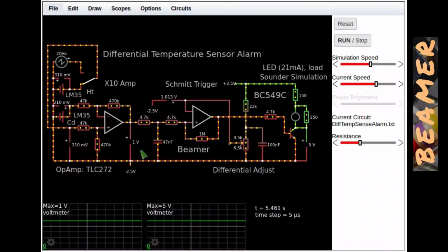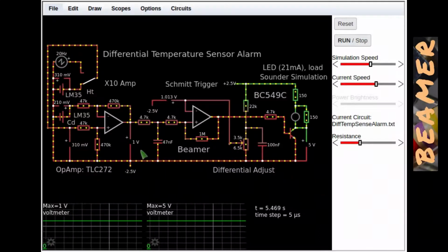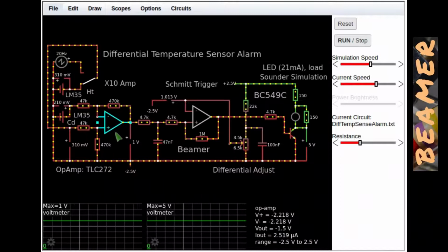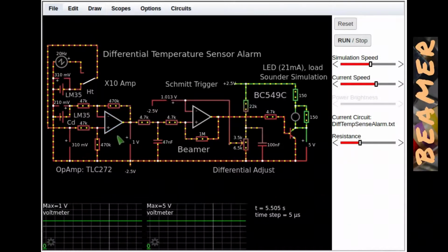Moving along, I'd like to say at this stage that the temperature differences between these 2 sensors can be minuscule, down to microamps, nanoamps. Transition between the 2 can be at a level that is almost at the level of the bias of an op amp, and when it enters that region, it can generate noise, and that noise, of course, effectively is transmitted further along this chain.